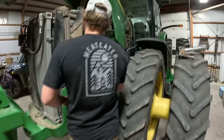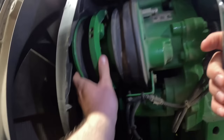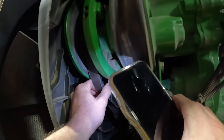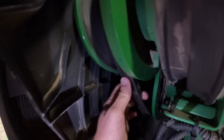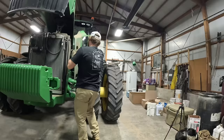I was going to grease the fan drive - look what I discovered. Can you see? That has a lot of play in it. And I also noticed - see that? That belt's on its last leg. All the cleats are gone off of it. Looks like it has been slipping on the pulley and there's all black residue like the belt's shredded. I think it's fan drive time - and if anybody knows anything about 8R John Deere tractors, this is like the most common issue.